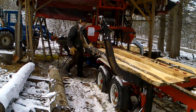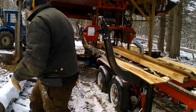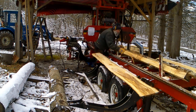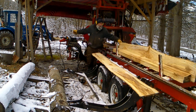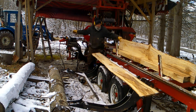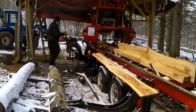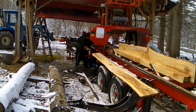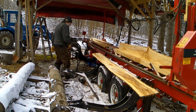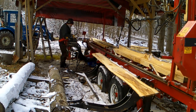The log clamps won't clamp a single board, so I leave a couple of boards up on the mill so that I can edge them. This makes it easy enough for me to clamp and then edge the board, and then I'll take all of those off at one time. This is another situation where being able to swing the controls in close allows me to hold the slab while I'm bringing the clamps in or out, up or down — another nice feature of this particular mill.